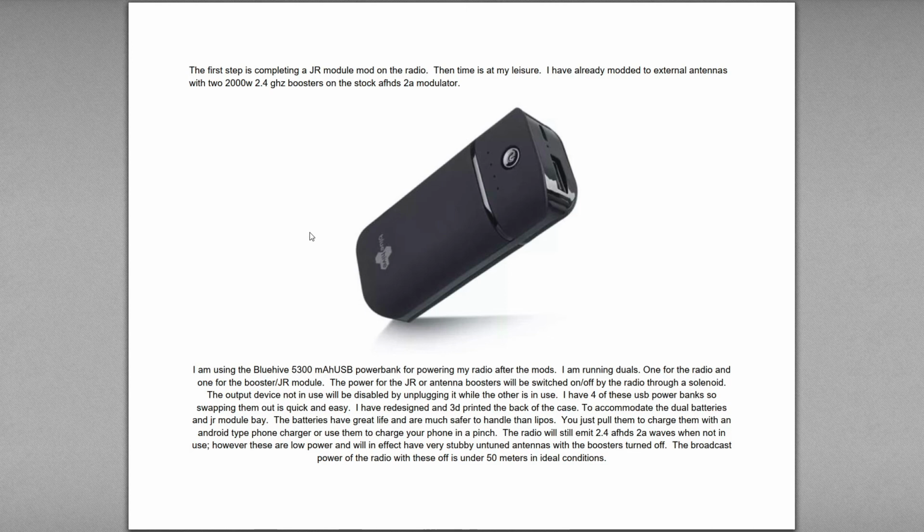Incidentally, you can go wireless with your simulator by just using a receiver and putting the PPM out of the receiver instead of using a cord. You just take a receiver, bind to the receiver, and then put it into your simulator cable that goes into the thing. Put a PPM output in there, and that's what it's looking for.